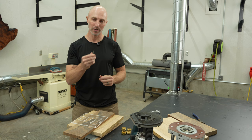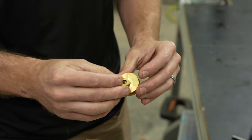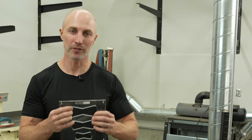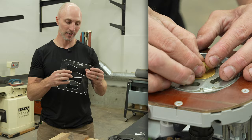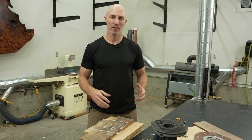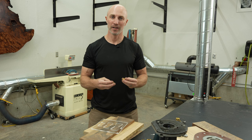This doesn't work if you change the size of your router bit with these same bushings. So with an eighth-inch router bit, this is the Whiteside inlay kit, and what it has is a smaller bushing and then a larger bushing that clicks over the top of it. You use that smaller bushing to cut your actual bowtie out, and then you take the same jig, add that larger bushing, and use that to cut your negative out. With the eighth-inch router bit it'll give you a perfect fit basically every time. The important thing to know is the offset between the two bushings — between the one you're going to use to cut your bowtie and the one you're going to use to cut your negative — needs to be a quarter of an inch.